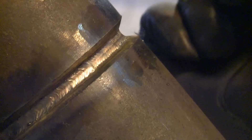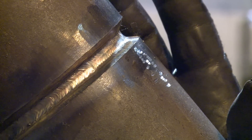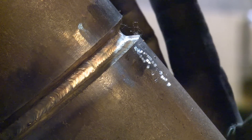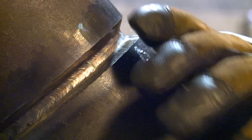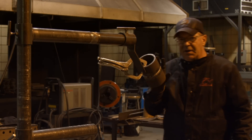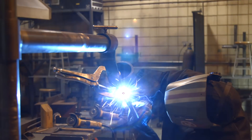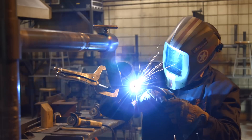A couple of things about this: it's safest to run stringer beads, although it's hard to get that profile. You've got to be so steady and smooth in your transition going around this pipe. I'm going to be using a product called a Velvet Shield. This pipe's going to get hot, and I want to rest up here and just slide and do the multiple stringer beads.